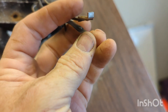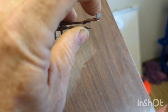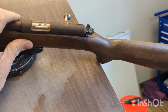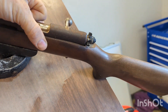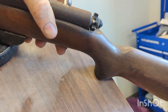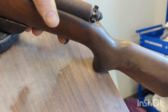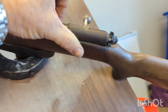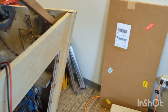So I shaved down just a little bit on that face so it's not as tall, because that's where the trigger mechanism pushes, so it won't be pushing it down when the trigger is in a neutral position. I'm going to put it back together and see if that works. I'm not bolting it back together yet because I'm going to de-rustify this gun first. You can see the trigger's down here — I can get my finger on it. I've got the multimeter hooked up to the Jones plug. I've got a little bit of travel before I engage it — it's engaging about halfway through the trigger stroke, so that's about right. I'm going to call that good.